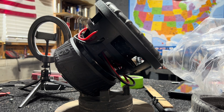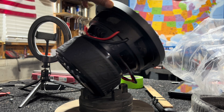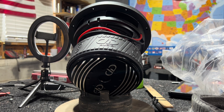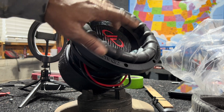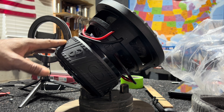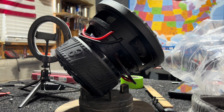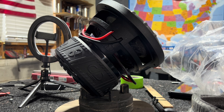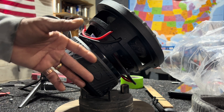That guy's on 3,600 watts and I'm not surprised — he's eating that power. This is a big boy. You can look at the motor on this thing — that's 7 inches across, 8-inch cone for sure. The pressure, man — look at that average score, it's hitting so many frequencies. But I'm trying to make it play loud and low, so that's why I'm losing a lot of power. If I was tuning the box a little higher, like most people tuning their box at 36 or 38, I'd be a lot louder at a higher frequency. But that's not where I listen to my music. Down in the nether regions — that's where I'm at.